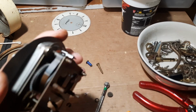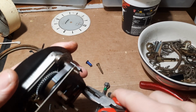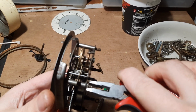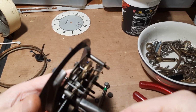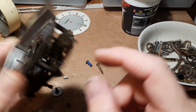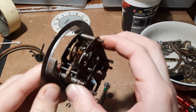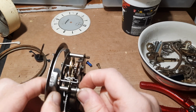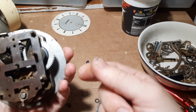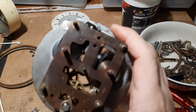And if the clock stops after you tighten them up, it might be because the balance wheel has been tightened up onto something. And as you can see, this pillar is rotating when I tighten the nut up. But that is because my rivets aren't that... I didn't really do a massively amazing job. It's enough to hold the movement on for sure. I can pull on this all day and it will not come off, literally. But it's not quite enough to grip it. But that's okay. We've got 3 out of 4 secure nuts, and the forces are going to be pulling away rather than rotating it, so it's not really going to matter too much.